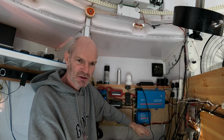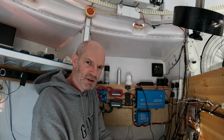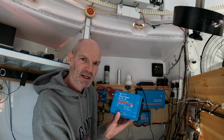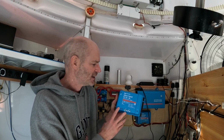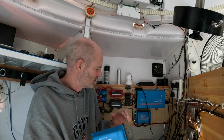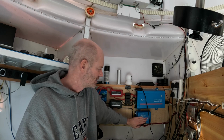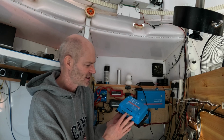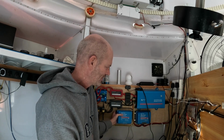And that's powered off the 240 inverter at the moment, but as I've been trying to switch all the AC loads over onto DC, I've got myself my next piece of equipment, which is a Victron Orion TR-Smart DC to DC charger, and it can also be used in power supply mode, which I'm using for the supplies to the telescopes. So for this one it's a 20 amp unit, and I'm going to be mounting it just on here where I'd left the space for.